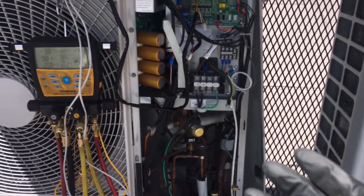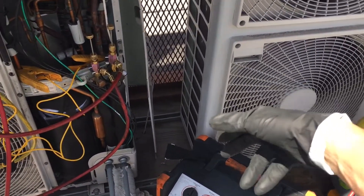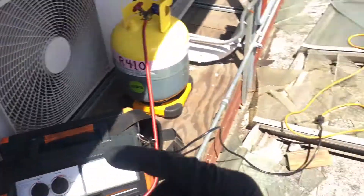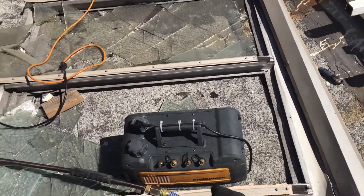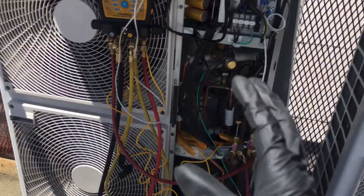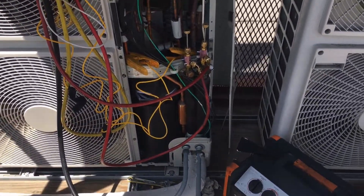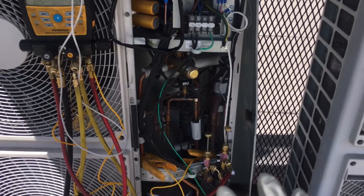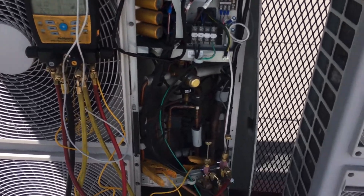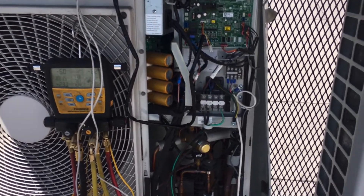On the next video, we should have the vacuum pump. I'm not going to haul my NAVAC 75-pound, 12 CFM, 3-micron vacuum pump up a ladder. In this case I'll use the Field Piece and just hook up the three-eighths hose and the quarter-inch hose and draw a vacuum that way. The system is never getting opened up to air — it's just getting recharged. There's no reason to get under 100 microns because it never saw atmosphere. When I first commissioned these units I had it on a vacuum pump overnight and got it down to 40 or 60 microns, so I know there's no moisture in these systems.